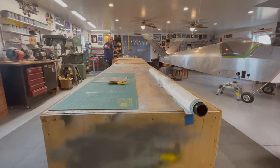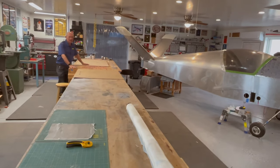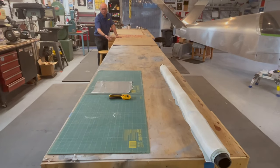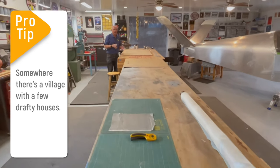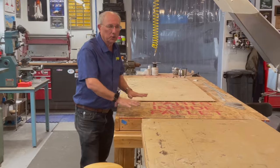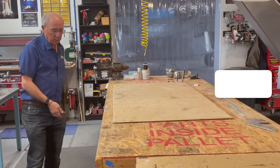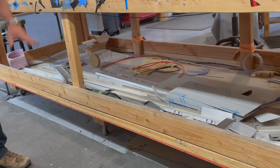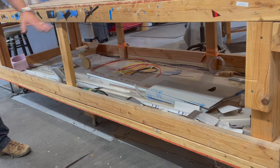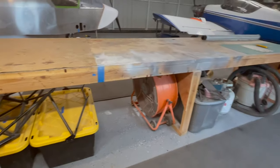Welcome to the workbenches. This massive workbench is built up of scrap wood — this one was made out of a packing crate that Arzino's motor glider parts came in, and the long skinny one is actually two hollow core doors on a two-by-four frame. When building in metal, you're going to be drilling a lot of holes in the top of your workbench. So if you put a fancy top on it, buy a thick piece of scrap wood as a sacrificial surface. It's also handy to use the space under the workbench for storage — parts for a kit, scrap material, large items, crates, and vacuum cleaners.